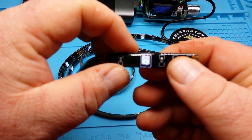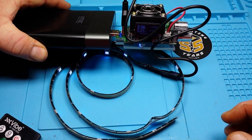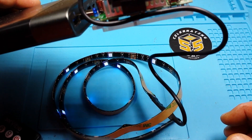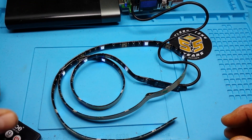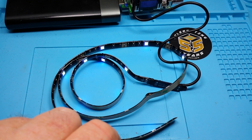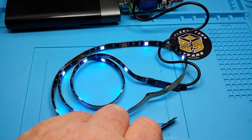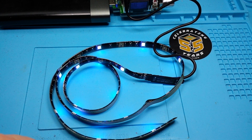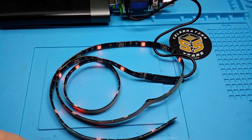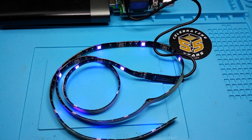I don't know how well you guys can see that, but all three LEDs are lit — there's the green, the red, and the blue. At the lowest power setting we are looking at 0.01 or 0.18 milliamps, changing a lot. At the highest power setting we're seeing a little over half an amp. Let's try red: red is showing 0.2 amp, green 0.2, blue 0.1 to 0.18 to 0.2. Purple: 0.3.